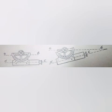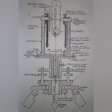This is a transit theodolite. It consists essentially of the leveling head, the two spindles, the lower plate, the upper plate, the level tubes, the standards, the compass, the telescope, the vertical circle, and the index bar or T-frame. The leveling head consists of two circular plates called parallel plates kept at a fixed distance apart by a ball and socket arrangement, and four screws called the leveling foot screws, or a tribrach plate with three arms each carrying a leveling screw.